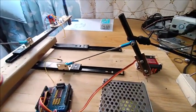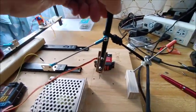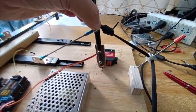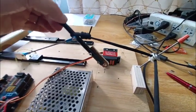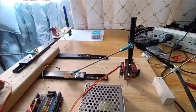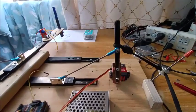Now I'll talk about some problems using servos — it's not really a good idea. One problem is the angle. When the arm is at 90 degrees and I tell it to go forward 10 millimeters, that's a different number of degrees on the servo than if I tell it to go forward 10 millimeters from a different position. At some positions I don't need to go as many degrees; at others I have to go further. So it's not a linear movement — the servo does not provide linear movement. The normal pen plotter uses stepper motors, and they provide linear movement.